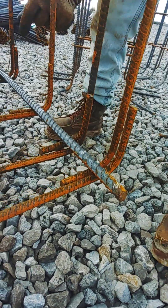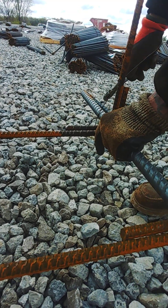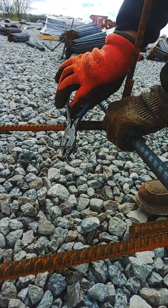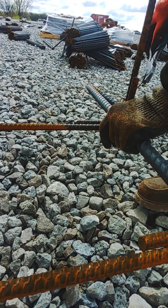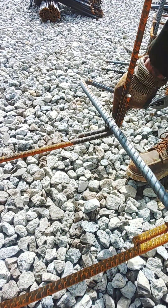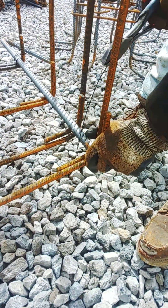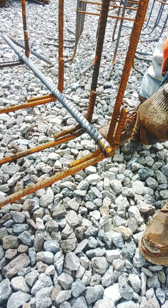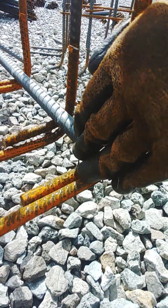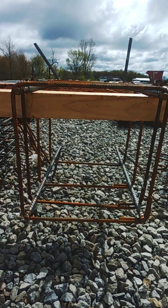Then we come to this other bar right here; we're going to make sure that this part is kind of at an angle. Then we do a column tie — once you do a column tie it'll help that tail not to roll down or up on you; it kind of keeps it in place. And then here you could do a saddle tie. A saddle tie is just wrapping all bars together so it twists, and that's how you frame up all four corners. When it's finished, the product is going to look like this over here.